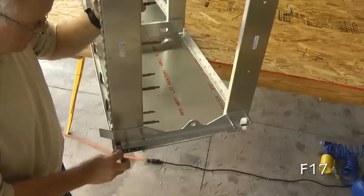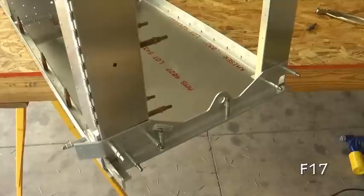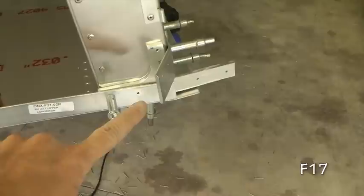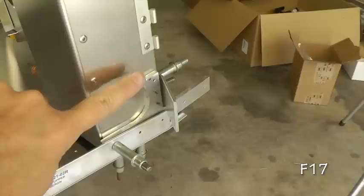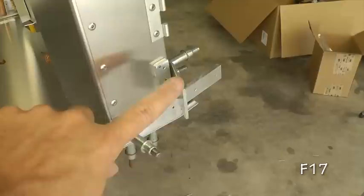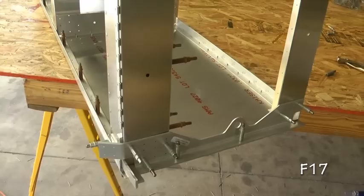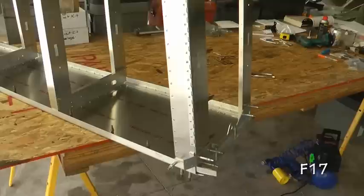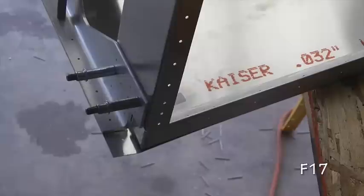Remember, our spacer is in here. Note that the holes should line up all the way into the top of the box. Note also the three rivets that need to be pulled first when we go to rivet, because this part would be in the way if we waited too long. So we need to up-drill to the final rivet size where all the holes line up. Eventually we'll get the other half of the fuselage in place, and it will work out the same way as far as the rivet connections.